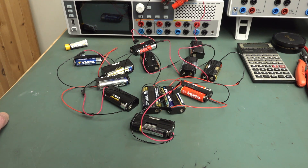So I needed a whole bunch of 1 watt 10 ohm resistors, and I just don't have those in my kit. I've got more than enough quarter watt resistors, but not in the volumes I'd need to put multiple resistors in parallel to get a 1 watt equivalent. So that wasn't going to work.